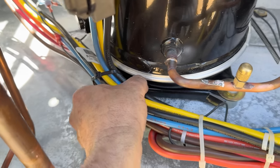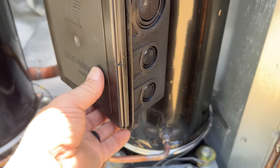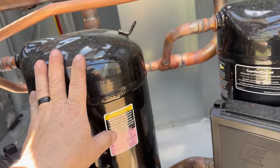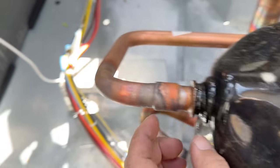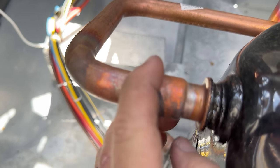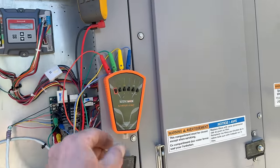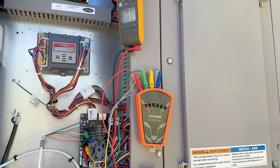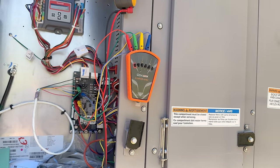We've got that wire tied — it's got a gap, going straight across and hooked to it. It's not going to vibrate as easily being loose. The way these work — first stage, second stage, third stage. Let's see if they got that hot. They didn't pull that in there real good. Let's go ahead and turn on the heat signal — yep, there goes the fan. Go Y1. Let's just do one for right now, that way we can leave that cover off. How many fans are running?